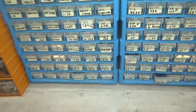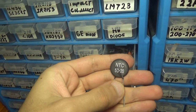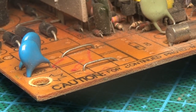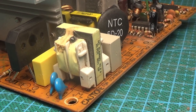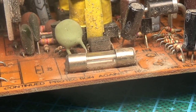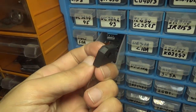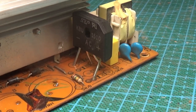Now let's look at what I will put in place of the dismantled components. Instead of the weak thermistor, I will set a 3D20 — for 7 amps, 5 ohms. For our purposes it will be more than enough. Next, I will put a common mode choke, instead of which the Chinese installed jumpers. Together with a pair of capacitors before and after the choke, this part of the circuit becomes a surge protector. I took these components from other power supplies. I set a fuse for 8 amps and replaced the diode rectifier with a ready-made 15 amp bridge with a reverse voltage of 1 kV — quite a lot for such a unit, but since the bridge will not be on a radiator, it is better to play it safe.